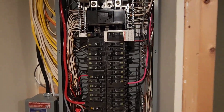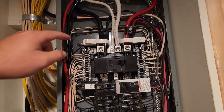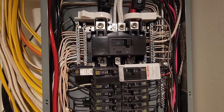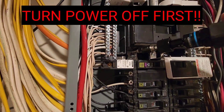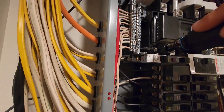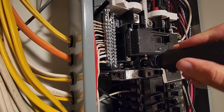So obviously we'd heard about this, but I didn't really know what the fix was, so I dug into it a little bit and went over to this guy's house and took care of it for him. It's actually pretty simple. The Square D QO recall with the plug-on neutral — this is one of the panels. It has a sense meter and solar on it. Really the only thing you have to do is those little star head screws in there — get on it with a torque screwdriver at 25 inch-pounds and just make sure these are tight.